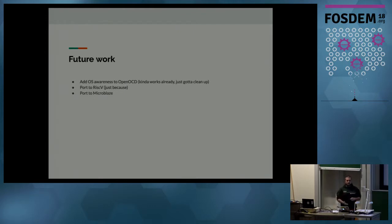It's very good if you need this kind of board level control that does power sequencing, power button control, LEDs, fans, those kind of things, because that's what it was designed for, right? Other RTOSs that let you create tasks at runtime, for example, might be more generic than Chromium-EC. That one just worked really well for my use case where I basically build a Franken Chromebook.